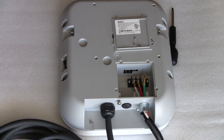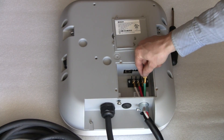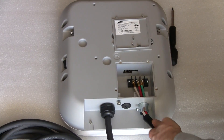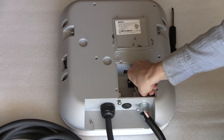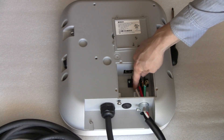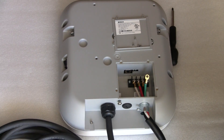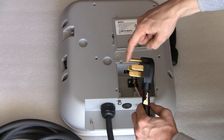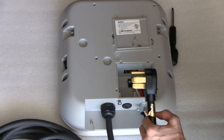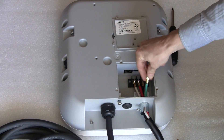I opened this door and I don't quite like what I see. This unused wire is just flopping around, and with no strain relief it can potentially move and touch one of the hot wires. I would recommend bending it away and attaching it with a zip tie or putting a heat shrink on it. Also, this white neutral wire is used instead of the green ground wire. They do eventually meet somewhere in the electrical panel, and if one is not used they are almost the same thing — but not quite. The safety ground connector is designed to connect first, before everything else — you can see it is slightly longer. So I would recommend using the proper ground instead of the neutral in this setup.